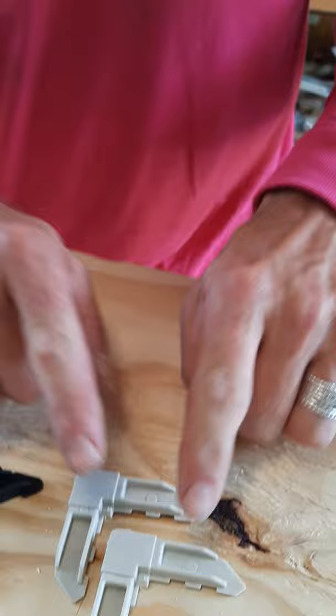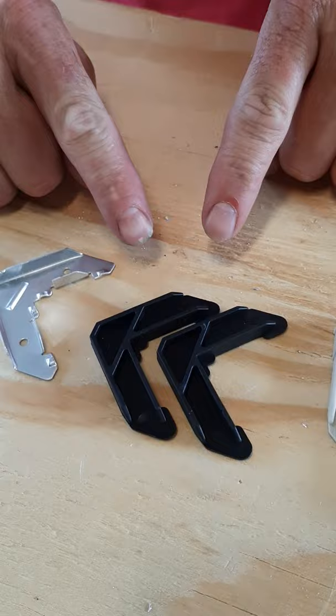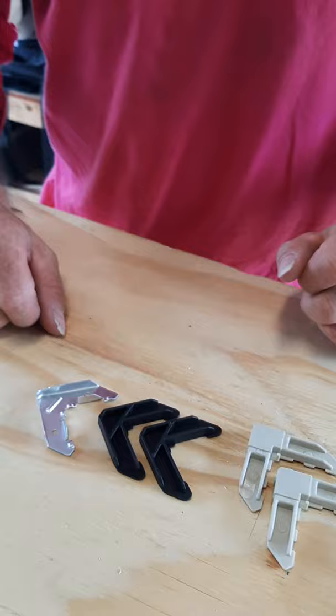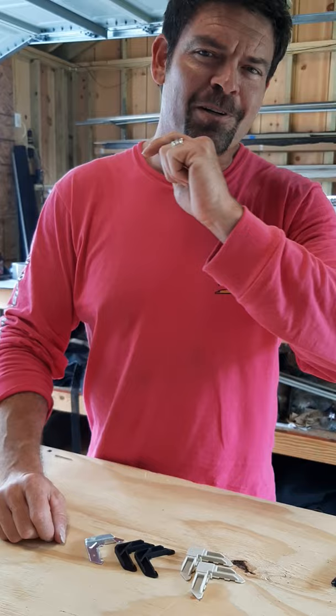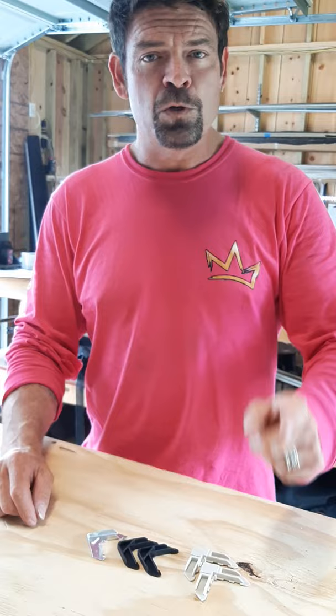We like to use mitered corners here in our area, just because we like the nice tight look. With everything in at a nice tight miter, we're never worried about the plastic dry rotting or fading as years go on. And of course, you can use a plastic or an aluminum inside corner — both of them are incredibly strong, both of them are going to last you, so it's whatever you like best. With that said, I'm going to cut my bug screen, which incidentally is milling color — basically unpainted. There are only five colors on the entire market and one of them is not painted at all.